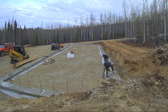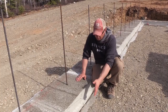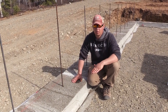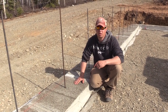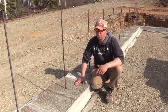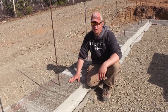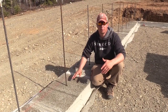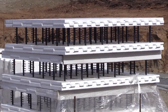We put in vertical rebar to tie in the structure that's going up. This new footer system worked really slick. In the future I'm going to do this more often because it's quick and easy and you achieve the same thing as building footers a different way. Hopefully this helps you build footers and saves you some time on your job site. Now we're stacking block — rolling right into the next process. Stay tuned for the next video and we'll show you how to do that.